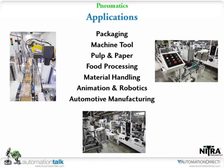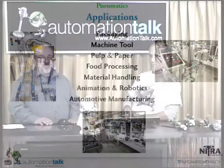I should mention real quick off the top of my head, pneumatics is air, it's compressed. There is some give and take, and I'm just going to throw this out. We don't sell hydraulic cylinders at this time, but there's a ton of applications that pneumatics are perfectly suited for. Although there are some applications where you're probably going to have to use hydraulics for higher forces and probably better speed regulation in some cases. But pneumatics are going to be cleaner and cheaper. Exactly. Yeah.